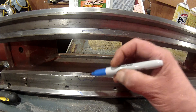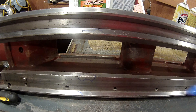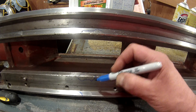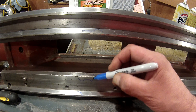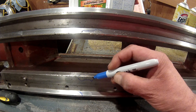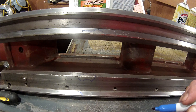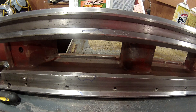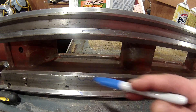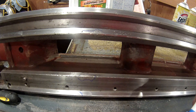Fortunately, somebody knew how to properly weld nickel into cast iron and then they reground it, so I can't complain about that too much. But if you're looking at an older machine that doesn't have hardened ways, you can see the outline of where the weld was. If they nickel welded it, that's great. If they bronze welded it, not too bad if it's a soft bed. If it was a hardened bed and they brazed it, then I would be concerned, because that would give us an area on the V-ways that's going to wear more rapidly than the hardened area. So that's something to keep in mind when you're looking at a lathe to purchase — give it a good examination on the ways and all the surface contacts for both the saddle and the tailstock.